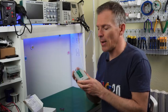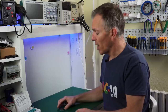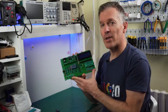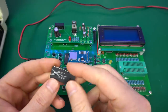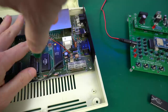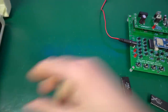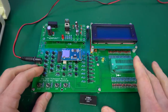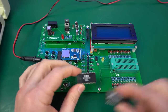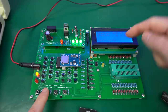Maybe there's a way to do this and I don't know about it. But that's okay, because I have another tool on my workbench that is able to read a 2364, and that is the 8-bit Museum Retro Chip Tester. Before we test the faulty ROM, I'd like to try it with a working kernel ROM first. I have my working VIC-20, so we'll just take the kernel ROM and test that one. The reason is that this tester will recognize certain ROMs and just tell us — it's a VIC-20 kernel ROM — so I don't have to download the image and do a diff on the computer. Let's select 2364 and try it.